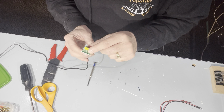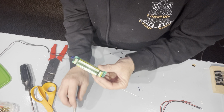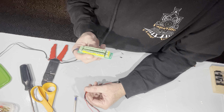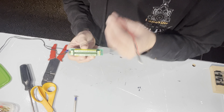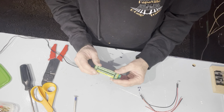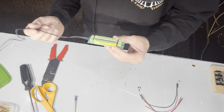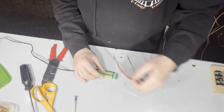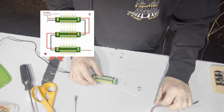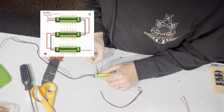It doesn't really matter — you have A1, B1, A2, B2, and so on. This one goes all the way up to B12. You could even use the far end as an additional connection point. What I think is really cool: these particular lights only pull about 20 milliamps, and this thing's good for 16 amps, so power-wise you could run a lot of these lights. Say you have three or four different buildings with lots of lights — you could have one line going out and all your lights going into building A.